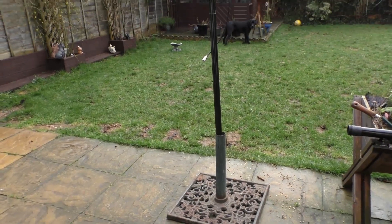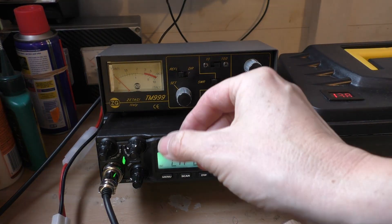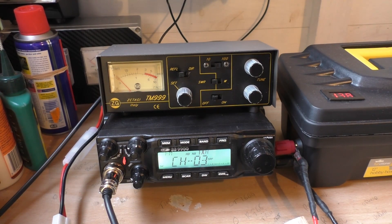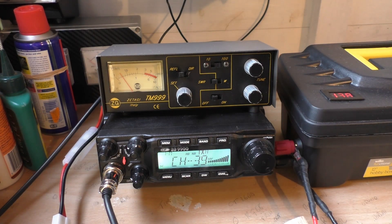Here it is vertical. I used an 8 metre pole — that's probably about the minimum you can get away with for this antenna, though 9 or 10 metres is certainly ideal. Now it's just a question of testing the SWR. This is only for my holidays, not a permanent setup, so I'm not looking for perfection. As long as it's below 2, I'll be happy — I know the radio is safe. I've got 1.5 on channel 3, and after moving it up slightly towards 40, the SWR dropped down a bit. I got it down to about 1.2 — that's safe, that will do.